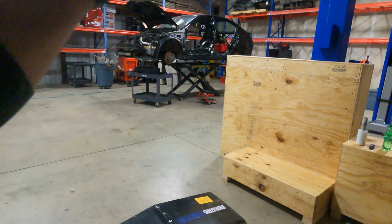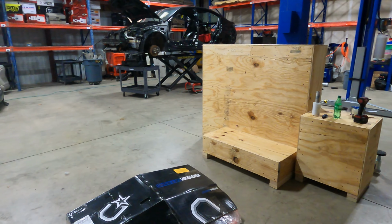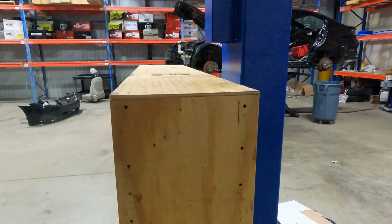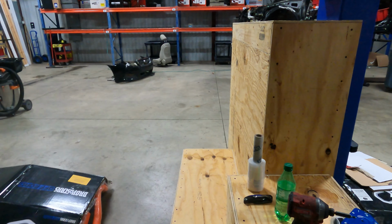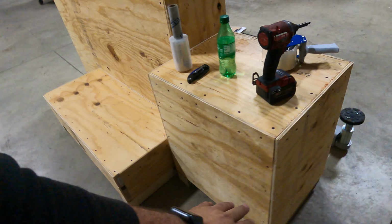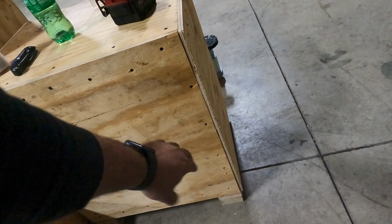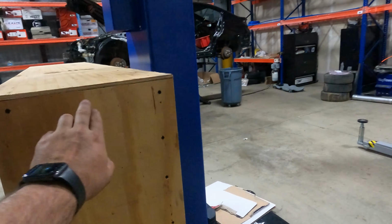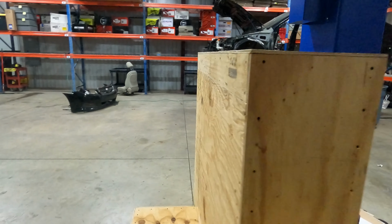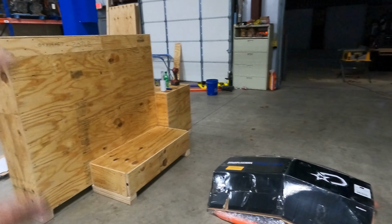So I kind of make two loops that go perfectly over, and then I sheet both of them, and then after that, I just strip enough plywood like this to cover the sides. This is the easiest and the most basic way you can do it. There's a lot of ways you can do it, but this is pretty much how I do it. And that's like whenever it's this tall, where the top window frame and then the bottom are further out, I also put 2x4s here. But in this instance, I don't, because the 2x4 ends right there, and right there, there's just no reason to put a divider. So that's pretty much how this all works.